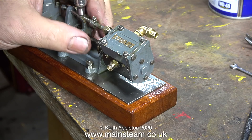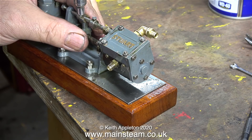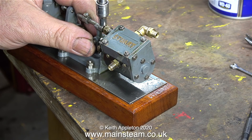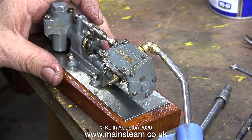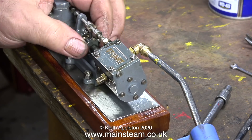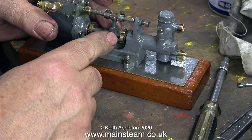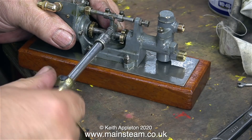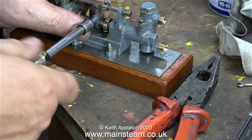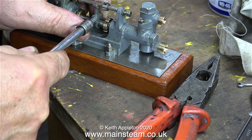Although it does run a lot faster and a lot smoother when I apply the air line to the exhaust. In this clip I'm adjusting the collars just to limit the amount of travel on the piston because I don't want the piston to smack into each end of the cylinder. This is quite a delicate operation and if the collars are not in the right place the pump will not run well. To demonstrate this, the collars are not in the right place so the pump becomes erratic again and occasionally sticks at the other end of the cylinder. At this stage I also found out that the main arm was moving on the shaft due to the extreme percussion that's been going on. When you tighten this you have to be very careful because it's pulling a tapered sleeve against the piston rod to secure it, and if you over-tighten it you will shear it off.